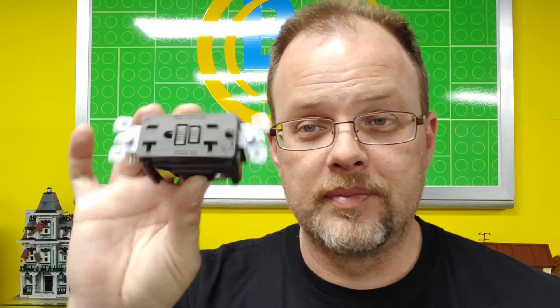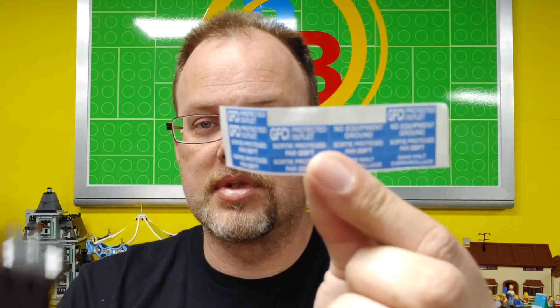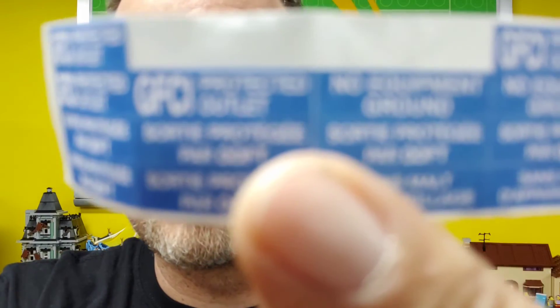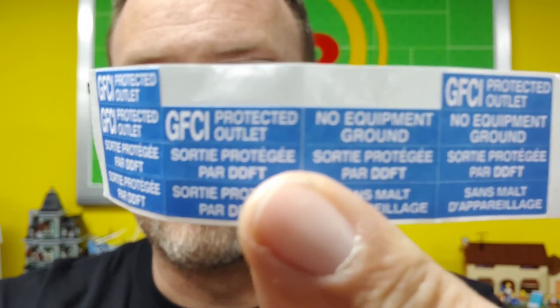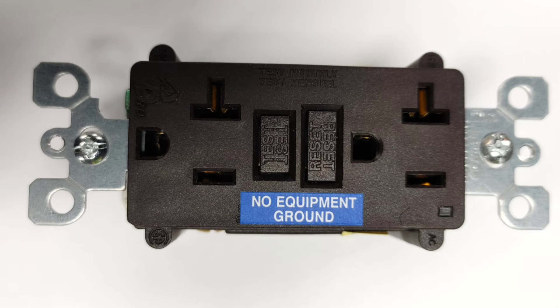What you do is remove that two-prong outlet and install a GFCI outlet. You can put this in your wall, use it as a three-prong outlet, and still meet code. The caveat is you're not truly ground protected, so you're not going to be protecting your electronic components. When you use a GFCI this way, there's a sticker sheet that comes with every GFCI — one of those stickers says 'no equipment ground.' You stick that sticker on the outlet, and that gives you a code-compliant three-prong outlet.